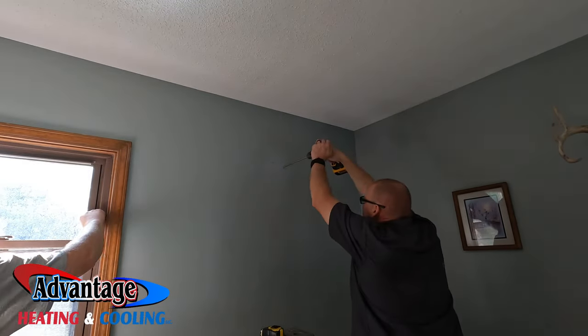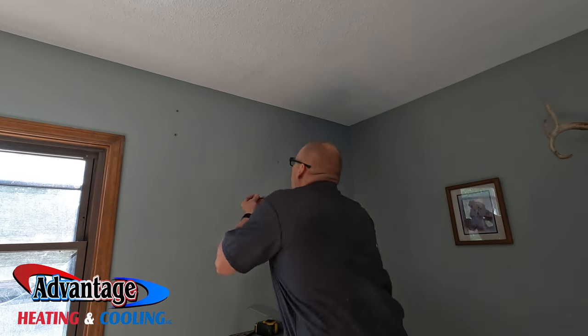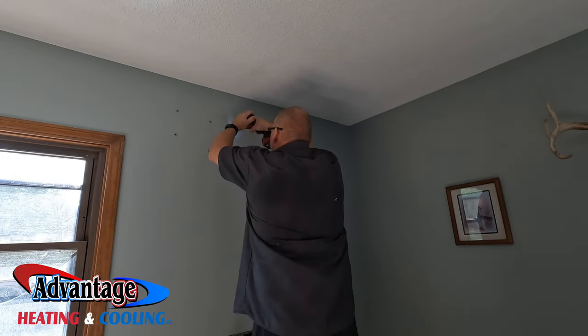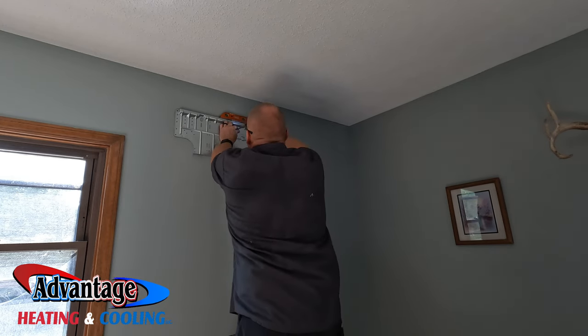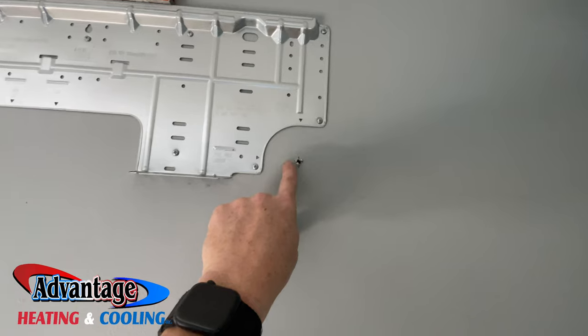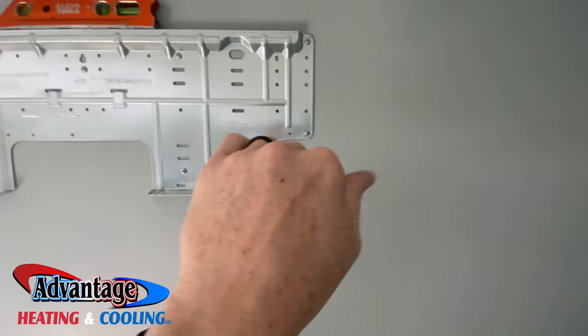It's done right there. I'm using these anchors — you just screw them in the wall with a regular Phillips bit, and this will hold up to 75 pounds. So here we're going to do a two and nine-sixteenths hole, and you've got your marks. You basically just line up where these marks are — that's your center hole. Then we'll drill on a slight angle downwards for the drain and all that.